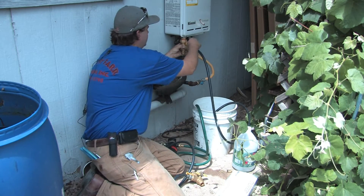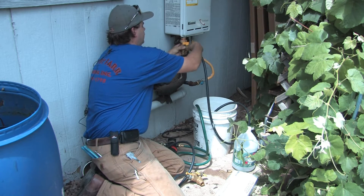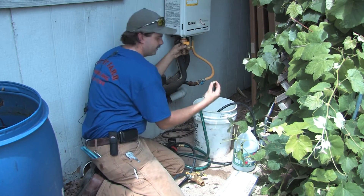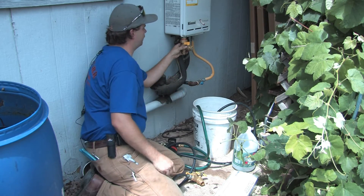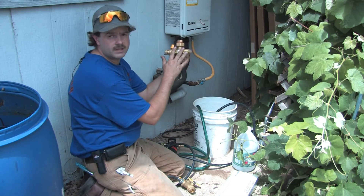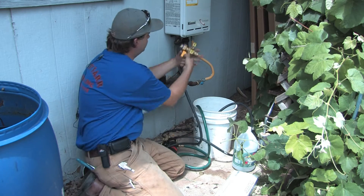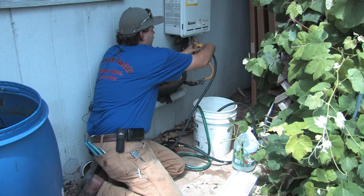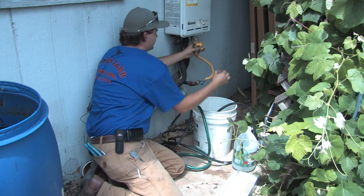Here's your hot side. You basically make sure your side waters are off. You shut this valve off. You disconnect your hose. Then that'll sit there like that. Some of these have little hose covers — you put that on there just to cover it up from any leaks. Then you do the cold. You don't turn the side valves on until you have everything done, and the first one you turn on is the cold. Your pump is off, you shut your inlet valve, you disconnect it, and you put your little hose cap back on.